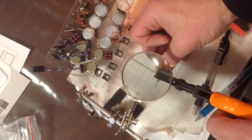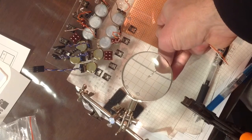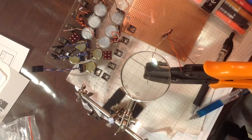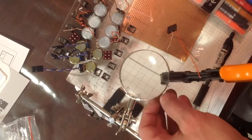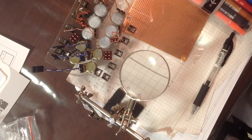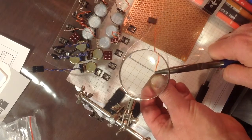So, what's the philosophy here? Well, keeping things in a modular, flexible system, which Molex provides. And there I show you my crimper. That's the crimper tool. Again, we crimp it. So as you crimp, and you do that several times, using your pliers to pinch the ends so that they smoothly enter the plastic housing.